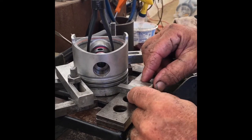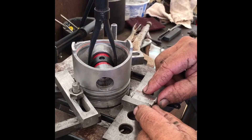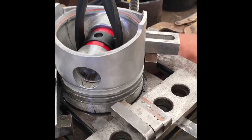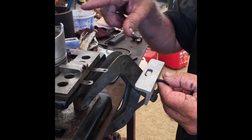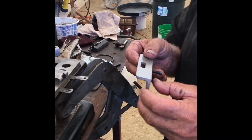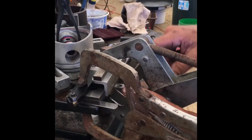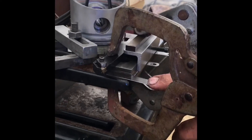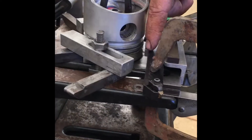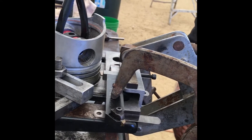These tools are support tools for our cutting tool. This one here allows me to watch the cutting edge. We're going to set this up just like this — that's how it's going to go on that part there. I've made this bracket here, and if you notice it has a little screw in it. This is going to push the tool in as a slide to continue making the cut. I'm going to clamp all this on because we're doing this in the field and we don't have all the luxury tools. We've shimmed the bottom up so we know our tool is going to be right where it needs to be to make our cut. This shim prevents deflection, and this is a stop that keeps the tool from being kicked out of the way when starting the machine. Rigidity is important even though we're going to do this all by hand.